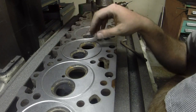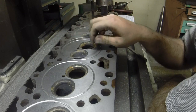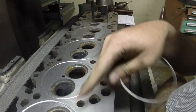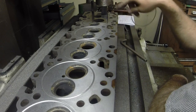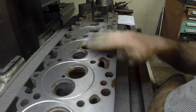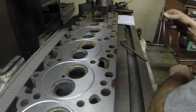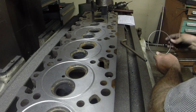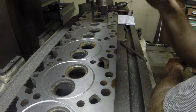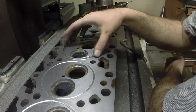But this is probably going to be an 80-90 pound boost motor, so it needs something better than stock. I've got the grooves cut out here and I know what the bore center is, but I went ahead and marked it so I can be sure that Mr. Bozo doesn't show up and screw up his head. I've got four down and two to go. I'm using a 120 radius tool bit — I like the radius tools; I don't like the square cuts in my cylinder heads because it makes them more likely to crack. So I'll use round grooves — that's my style.